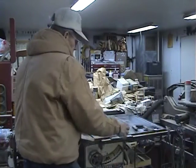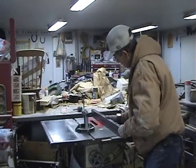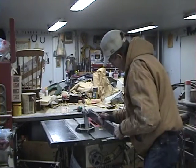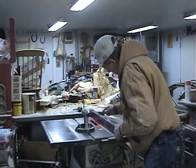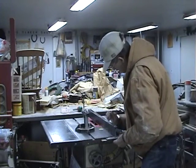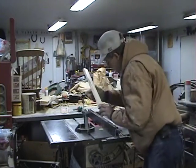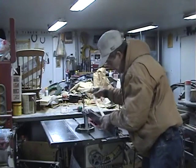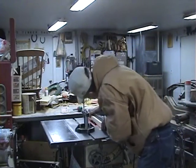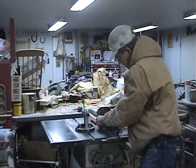On a dado, you're cutting all the way out the end, so you can't run your fence all the way against your blade. You've got to have a sacrificial fence. Take your fence and move it over there — you've probably got about a half inch. Lock it down. Then you start it up and let the saw blade cut a groove in there. This is where your blade will run. After you get that done, take your C-clamp and C-clamp that sacrificial fence on there.